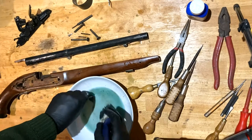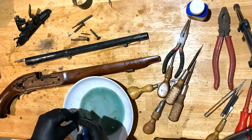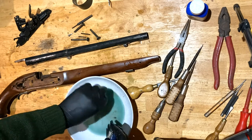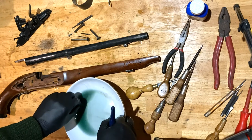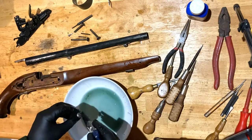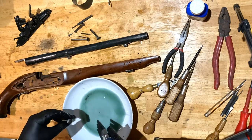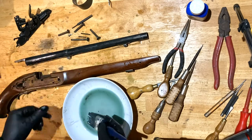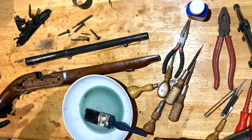So there we go. One unholy mess. It's funny, actually. This is bluing really well. Isn't that ridiculous? If this was a nice old English shotgun, it would take ages to blue. Sometimes they just don't. The Spanish shotguns are the worst. The Spanish steel is quite bizarre. Anyway, there we have it. So I've got to discard this bluing solution now because it will go over.